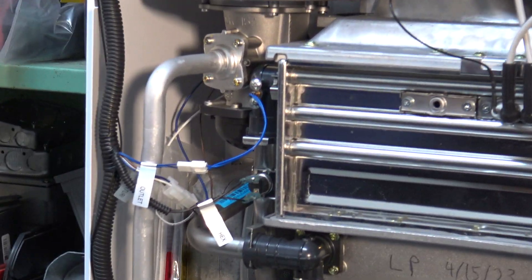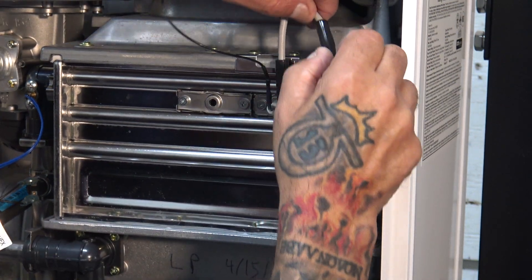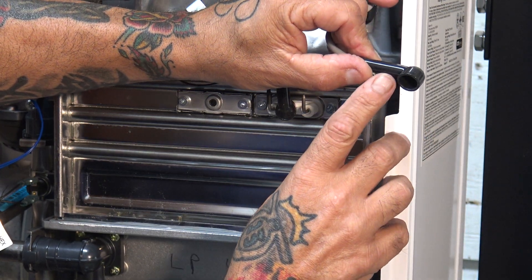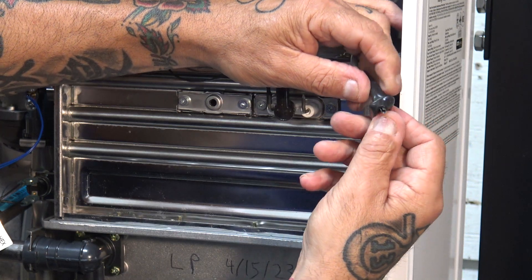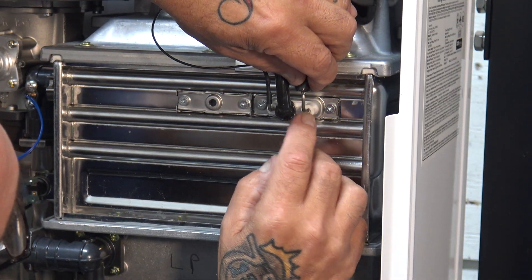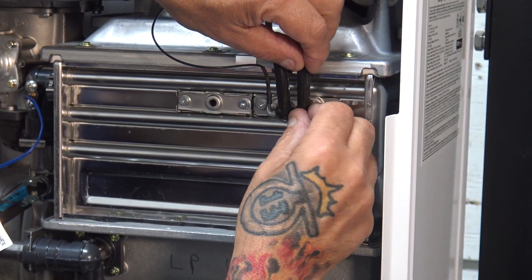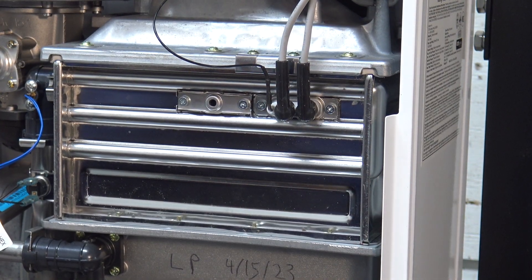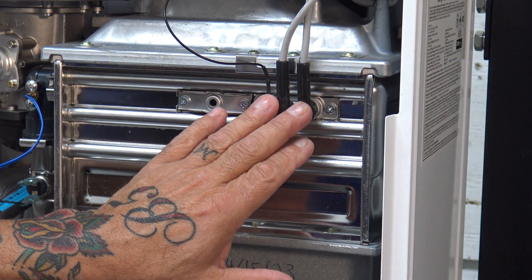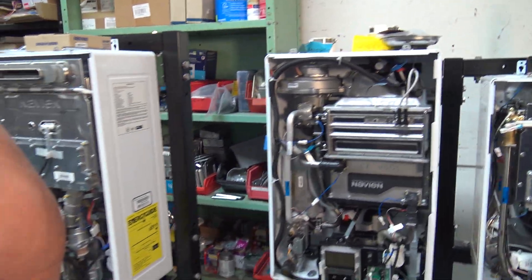So that's how it looks. You see how I'm pulling it out of the rubber — then just get it right on and push the wire down. Use two parts of your thumbs and push on that. Don't try to push this straight down — it's tough. That's the best way to do it. The older this gets, the softer it gets, the easier it gets. So that's cleaning your flame rod assembly.